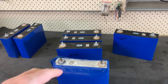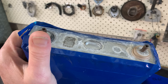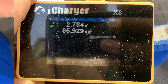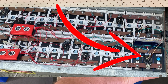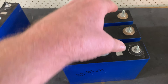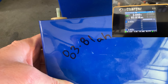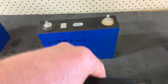Well, that was the biggest disappointment — I expected an epic thumbnail of this battery going skyward in a trail of fire, but unfortunately that didn't happen. I know it's stained, I know it's bad to keep using it, but bloody hell, these things are resilient. That was 96 amp hours. From memory, the one beside it was also 96 amp hours. These three cells from cell one — the ones that were self-discharging, which started all the problems with this battery — still came in at 83.81 amp hours, 79 amp hours, and 77 amp hours. That is a very unexpected result.